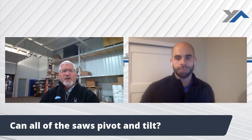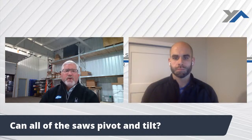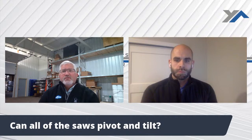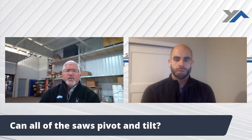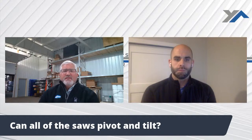In the sign market, typically you want to tilt as much as possible when it comes to cutting angles, simply because you're utilizing the whole blade. Whether or not you need 12 inches wide or not, but you might have, let's say, a 2x2 tube that you can put 3 or 4 parts up on the table and get the same length for your cutting. That's probably the biggest advantage from a single to a double miter saw.